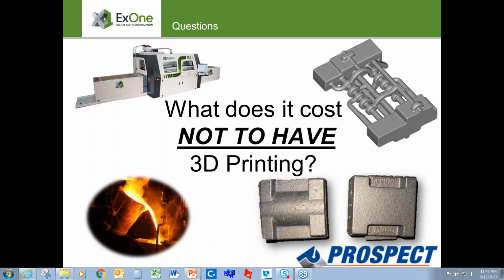I'm not sure what the shelf life would be on that. The furan is a strong resin, and it hangs together quite well over time, very similar to the shelf life of a shell core, which is many months. Right. So yeah, I appreciate that, Greg and Bob, for mentioning that.